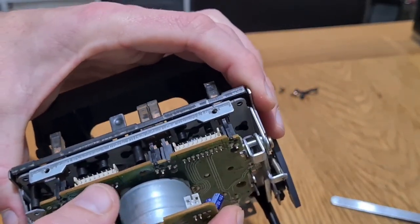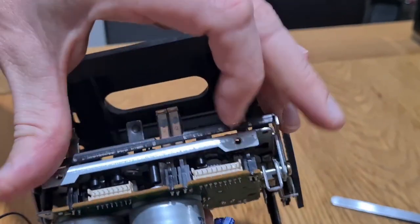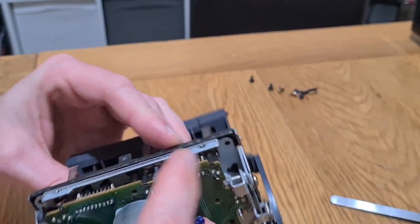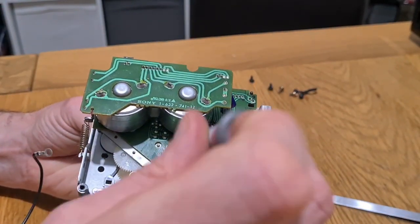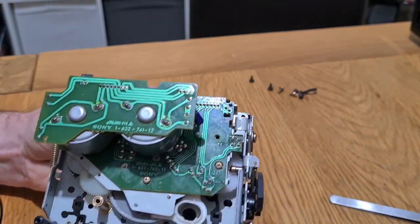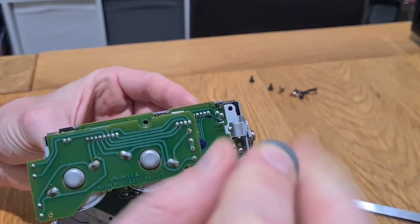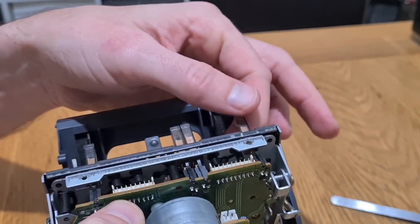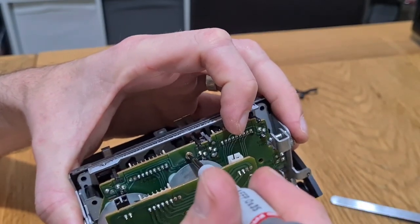As you can see it all sits on these little black plastic legs. Take your time, eyeball it, line it all up. If you haven't touched any of the cams or reels you haven't changed anything — just make sure it's sat flush. Once you're content it's flush, start putting your screws back in. Remember that little center one goes in a couple of threads and it's done — don't over-tighten it or you won't recover those threads. Go around and do all the screws first, making sure they're all equally tight all the way around.